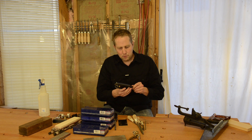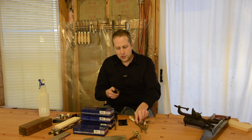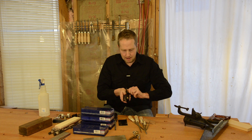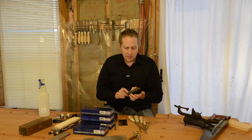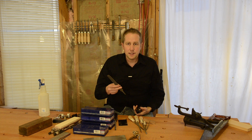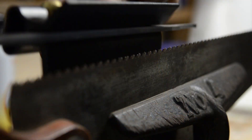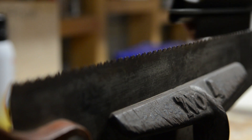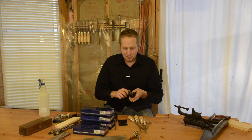Before you begin actually sharpening the teeth on your saw, you usually want to flatten the teeth first, and it's best to do it at a 90 degree angle. I use one of these bastard mill files, and Veritas also makes a nice holder for this — it's like a file jointer, I think. I can't remember exactly what it's called, but I'll share a link to it.